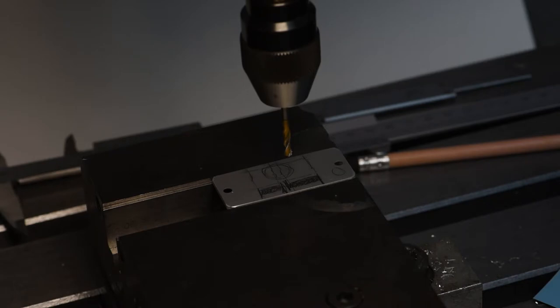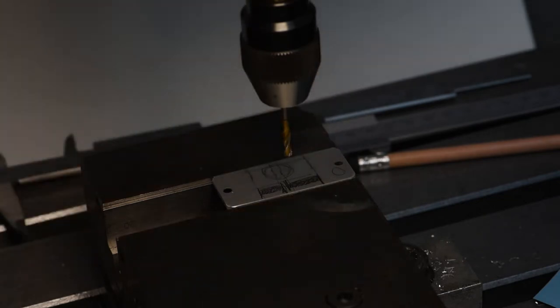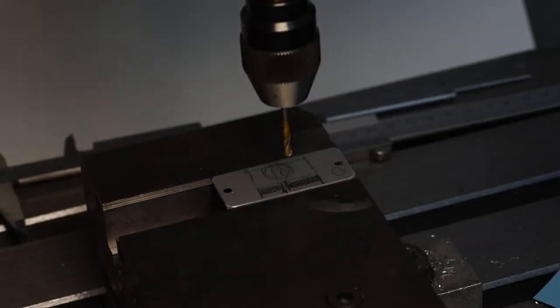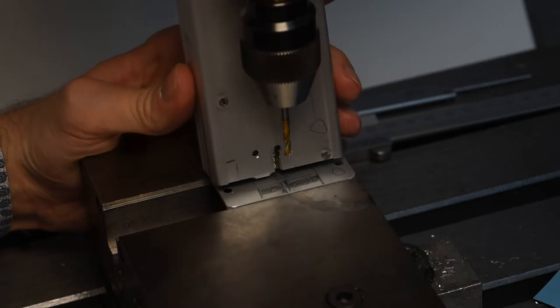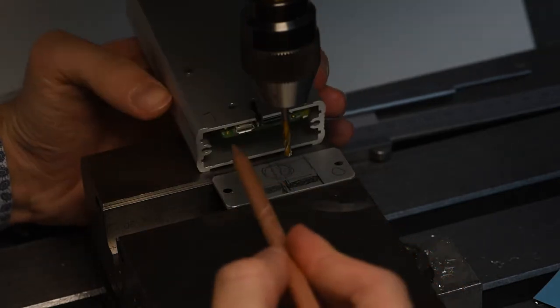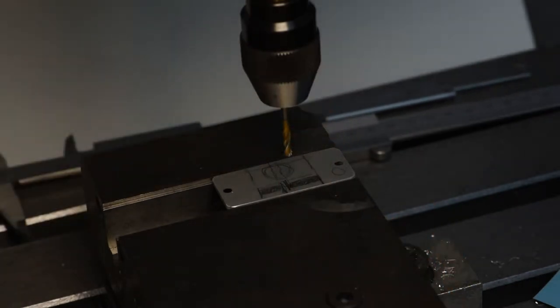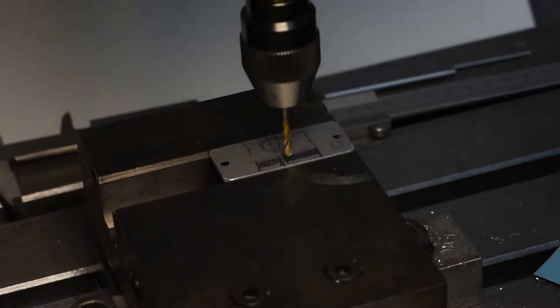Moving now to the forward plate of the aluminium body, we've mounted the pyboard inside the body, as you can see in this shot. So right now, again, we have the fixed defined location of the pyboard, so we can measure whether our initial contours were correct and adjust them. You can see we've made some minor adjustments, and now that we know where exactly the slits are located, we can move on to drilling them.